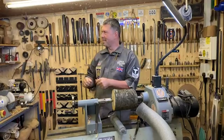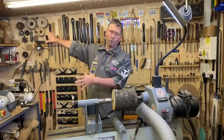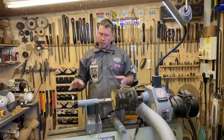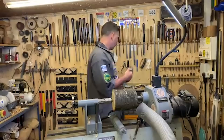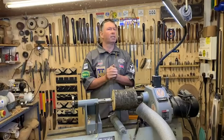Normally if I'm wet turning, I have a tarpaulin on hooks in the ceiling that I drape all the way around just to protect my shelves from getting covered in shavings. It's not there today so we're going to get a little bit of mess. What we will need to do when we finish today is clean down the bed of the lathe. This is soaking wet timber - the lathe is going to get soaked with sap, which is really corrosive. On every metal surface including your centres and tools you'll need to clean them down afterwards. I go straight for camellia oil - wipe them down, then camellia oil on the top wiped in nicely to prevent problems and keep the bed sliding nicely.